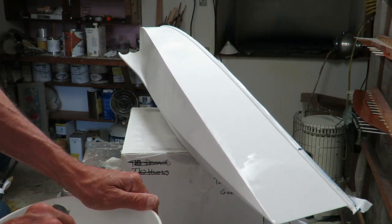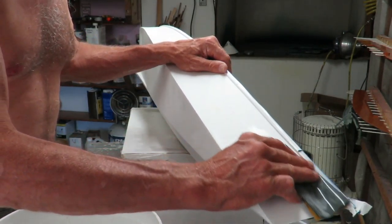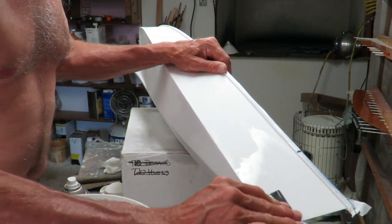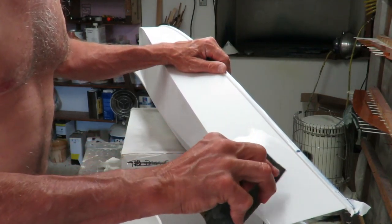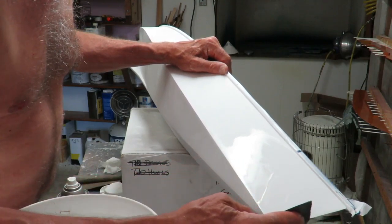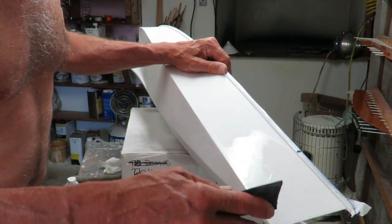And the other point is, we're no longer sanding wood grain. So it's not just a matter of back and forth with the wood grain now. A variety of strokes is actually your best bet at this point. And so you can sand in any direction. At the front, I find it's best to sand right up. You don't want to sand over the edge. If you sand over that bow edge, I might just touch that very lightly like that, but you really don't want to sand it at all, rather than just brush it, or you'll be through any coating on that sharp edge.